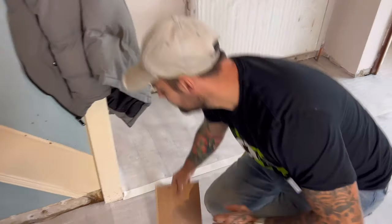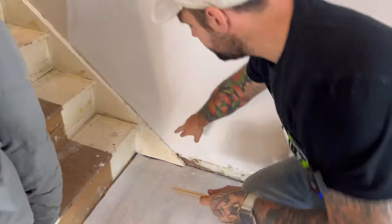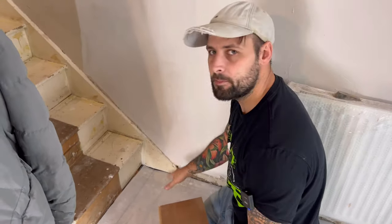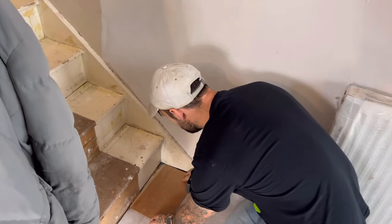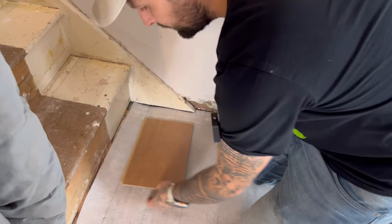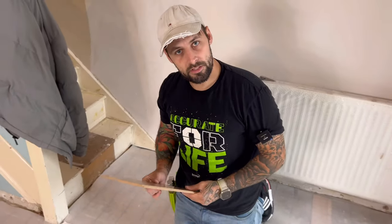Follow me. So this is called a stair stringer. If you've got one, these are normally fixed to the brick wall, so you can take a bit out. It's not the end of the world. This one's actually already been done at some point. We just need to trim it a little bit more. We're nearly under, not quite. We've got another set of doors there. We're going to undercut that frame there as well, and then we'll move on to the next. So let's get that done.